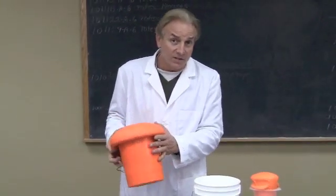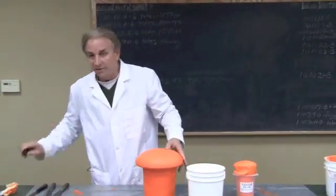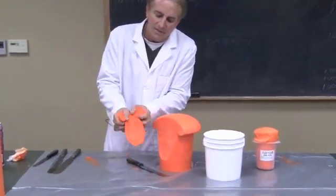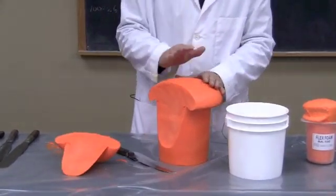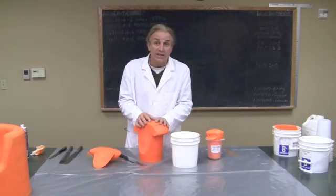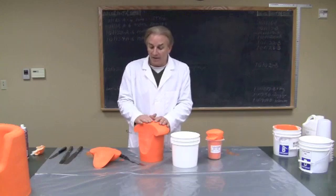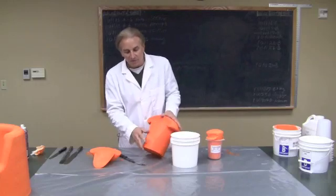Now this material is a little different than our lighter weight foams because it does have the ability to form a great skin. Just taking a knife, like a butcher knife — I'm going to carve into it. Nice, flexible, but it's open cell foam with a really nice skin on the outside. Silicone molds work great for this material, but if you don't have silicone molds, urethane molds or other molds will work great as long as they're sealed and you use a silicone release agent. The color — we have about 12 different colors that you can add to it. With no color, the foam is snow white. But we've added just a simple orange pigment at about two percent of the total weight of the material, and you can see it gives a real vibrant color.